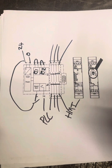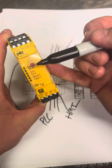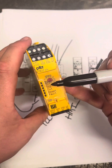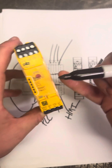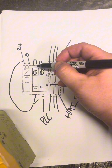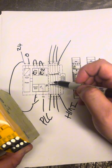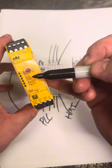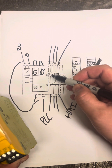I'm going to do a quick brief look at what you'd see if you saw the relay inside the panel. We've got our power LEDs there, showing you've got your 24 volt on A1. And then you've got your inputs, one and two, showing that you've got your 24 volt on your inputs. If you've got the inputs there, that will also pull in these contacts. But if you haven't got input one or input two light on, that won't pull these contacts in.